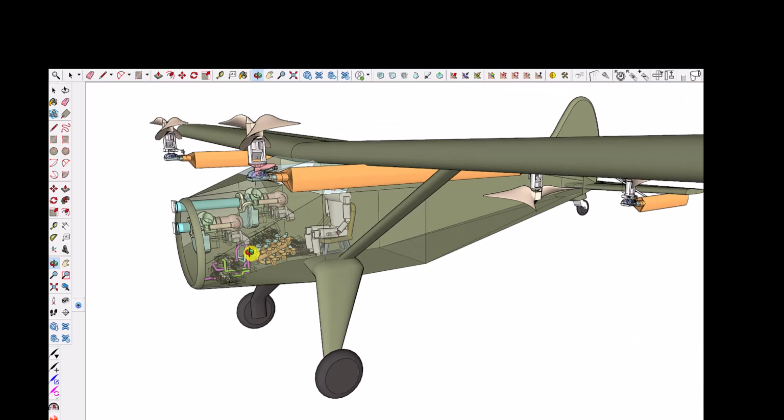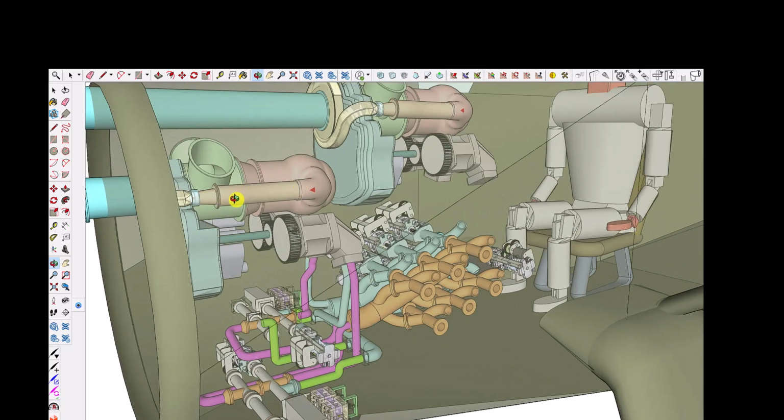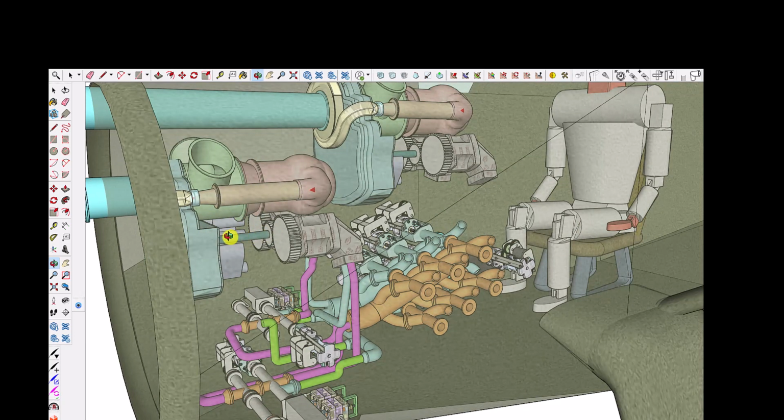I will prepare a more complex YouTube video that shows one of the pumps is the VP1 pump by Parker Hannifin, because it has a variable displacement, so you can alter its flow easily. The other pump is the F12 125. You need 2 of those, and an F1240, you need 1 of those. And if you take the 850 Newton meters of torque that these jet engines can create, this shaft has 850 Newton meters of torque and spins at 6,016 RPM.